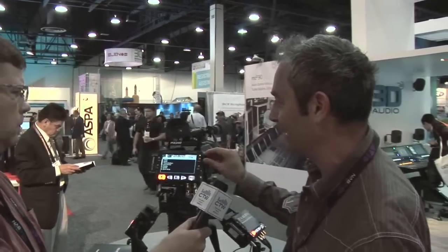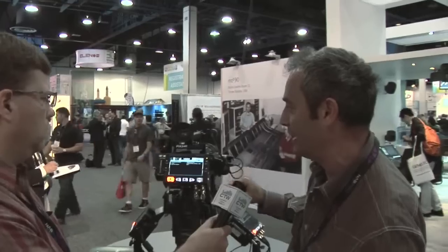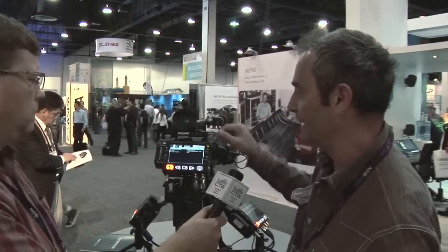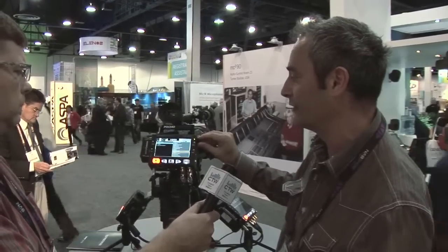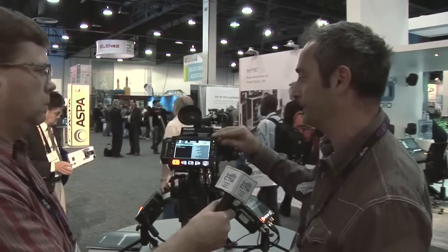The intuitive menu system allows you to quickly go to the video menu, select your video input whether it's HDMI or SDI, and then choose what resolution and rate you want to record. So I can take a 1080i 59.94 signal and convert it to any of these different resolutions and rates on the fly. We can even do things like 3:2 pull-down removal, which is an essential feature these days. Now I want to talk specifically about some of the new features introduced with version 2 firmware.